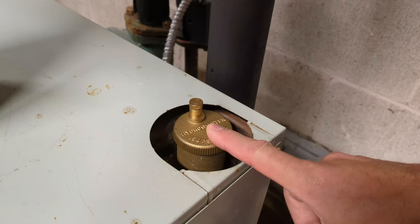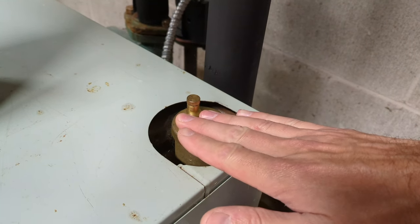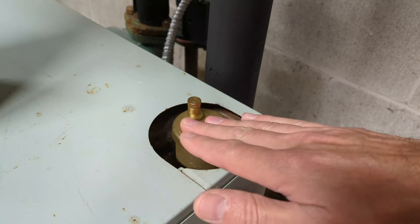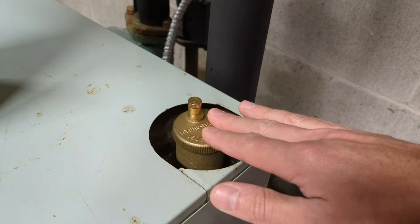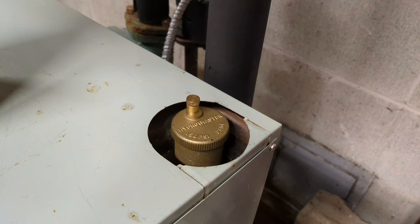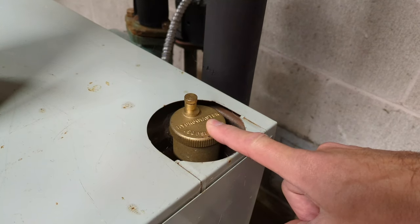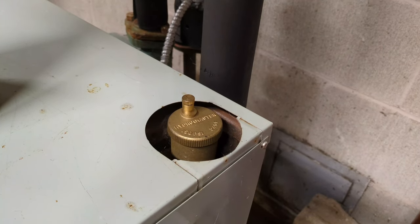For the vent on top of the boiler you'll definitely want to wear eye protection and gloves. With the heat off right now you still have the pilot light going so it stays a little bit warm — almost a little bit hot to touch — so that water will be a bit hot. As long as you're wearing some safety gear you'll be fine. I'd actually do this one last if you're replacing all of them, so there'll be a little bit of pressure relieved from the system from when the water sprayed out of the other one.